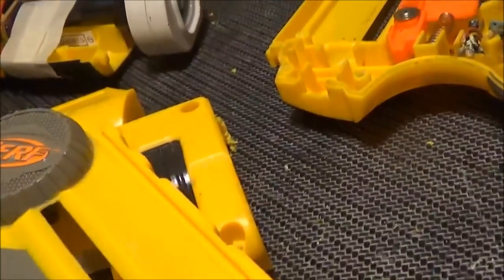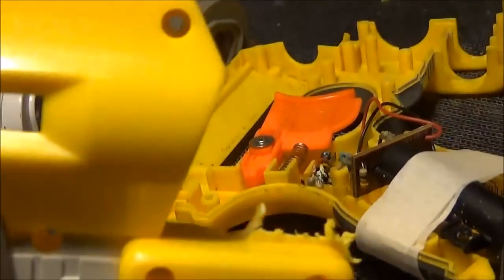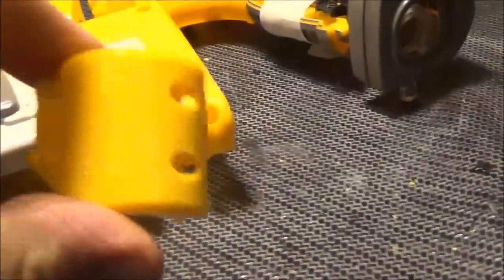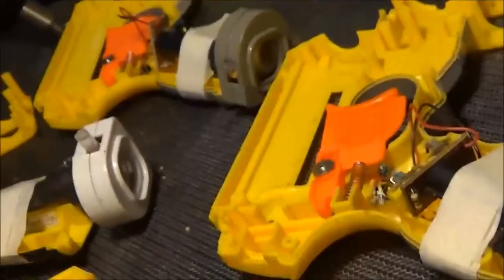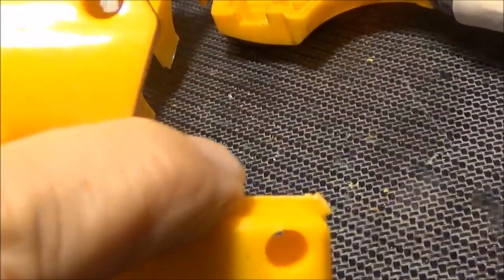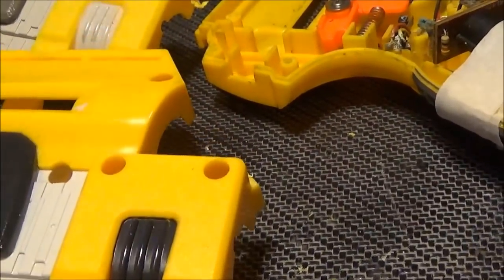Wobbly cam time. When you do your cuts and you take these things off, these little parts here, which is just the flashing that goes around the front of the barrel, see how it's kind of ugly and it's sitting around, and this one's actually broken, which sucks. See how there is a lip that goes over these. You want to make sure you leave enough so when you do this, you can go back and clean these up. You have enough to make sure it's flush as you grind it down. So that way you don't wind up with a horrible, horrible mess.